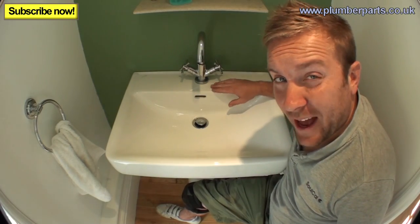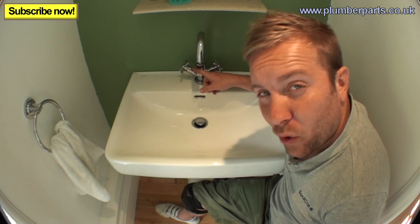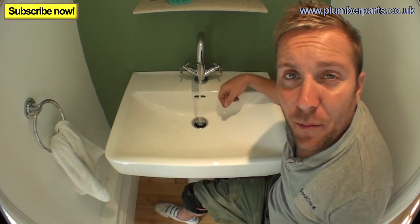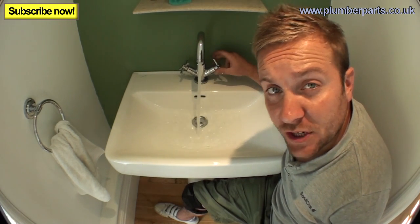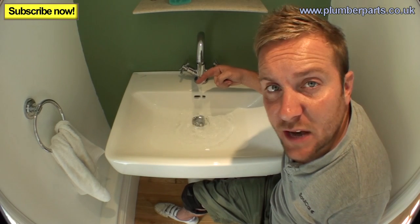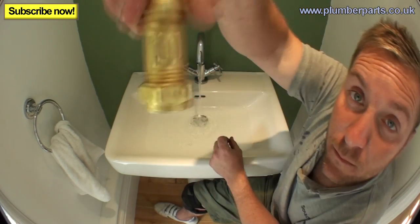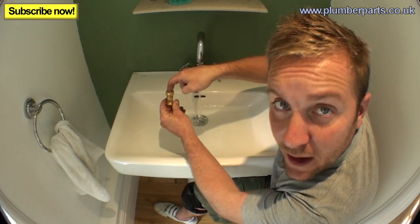We've got this sink here. On one side we've got mains cold water, and on the other side we've got a pretty poor flow on the hot water side. There's no non-return valve on the hot water side yet. What happens is, say you've got the hot water open — there's not much coming out. You open up the cold and it flies out at a much higher pressure and pushes cold water back down that hot pipe. So the hot is now running cold. Wait a few minutes and it'll come back hot again. To prevent this, we put a non-return valve in on the hot side to stop the cold water pushing back down that pipe and back down the system.